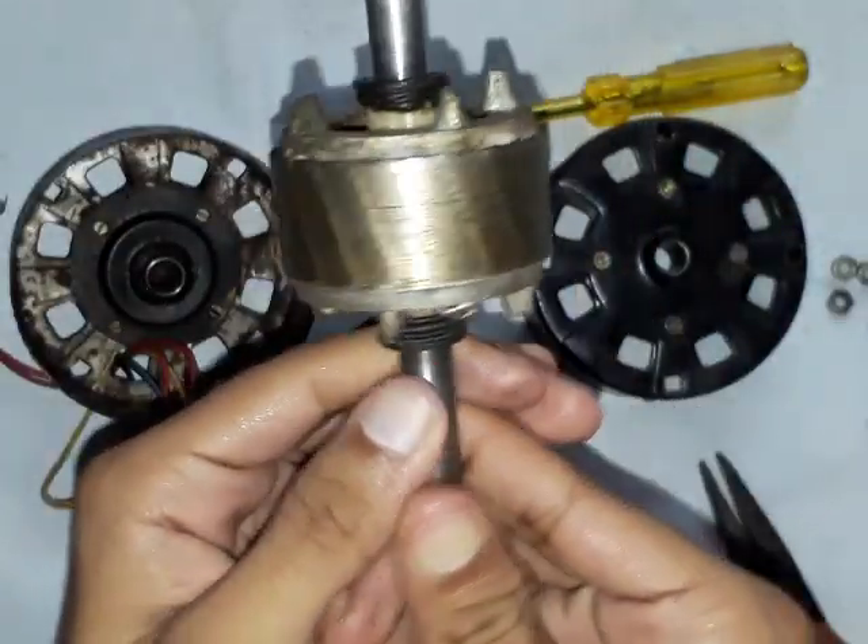I will check this by connecting this lamp in series. Let's check the windings — I will connect this to the mains and find the terminals of the winding. See how I am finding this: this is one winding, and this will be the rest — the other winding. This is one winding and this is the other winding. I have got it.